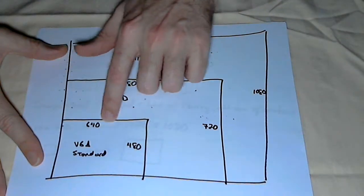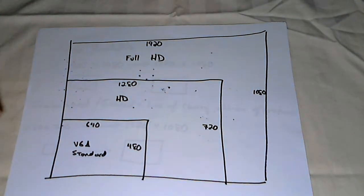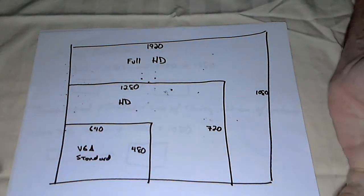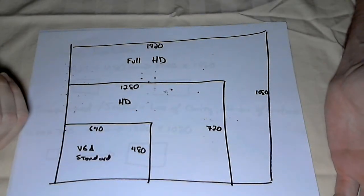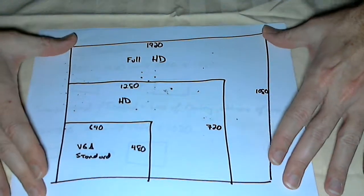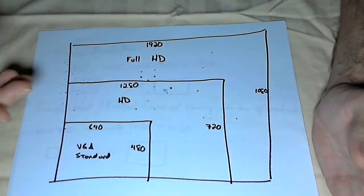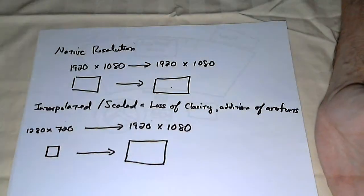And remember, this is a count of pixels, pixels vertical versus pixels horizontal. So that's something you need to remember: the more resolution that your CCD or your sensor can record, the finer the image, the more granular that video signal is. And therefore, since that much more data is being recorded, that much more storage needs to be used up. So higher resolution is going to equal less time on a card, ultimately, because of more storage.